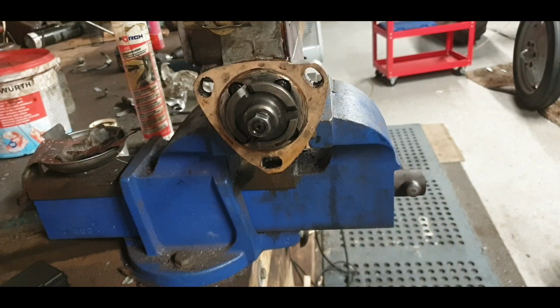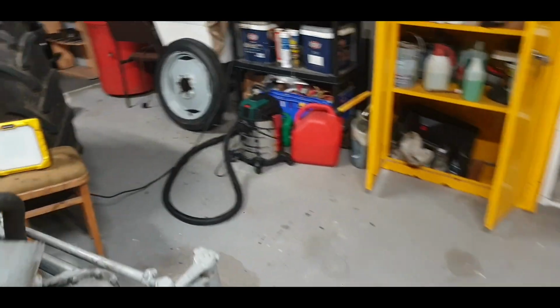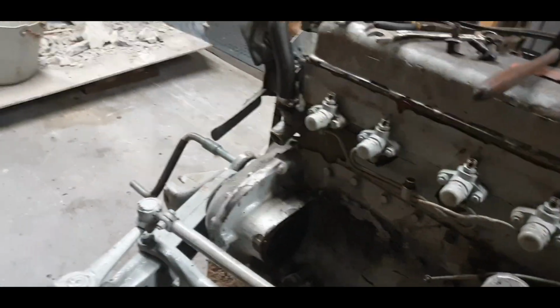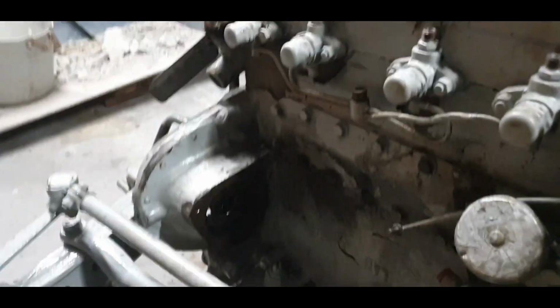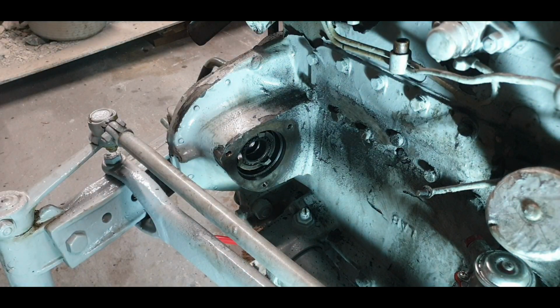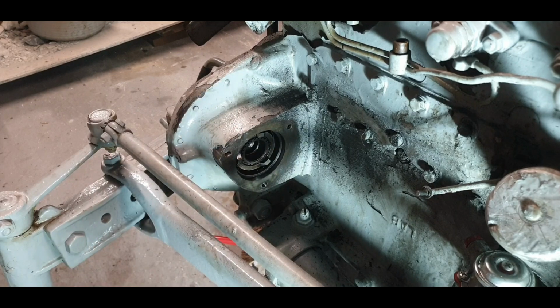So next thing we've got to do is get this baby ready for spill timing. But before that, because I like to keep that delivery valve holder in place, I'll work on the place where that diesel pump is attached to the block. I want to get that nice and clean, because there will have been a bit of oil sitting around there. Yeah, they'll have a bit sitting in there, keeping it wiped.